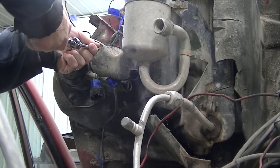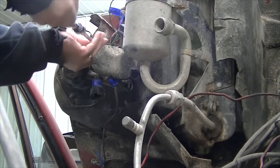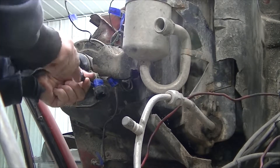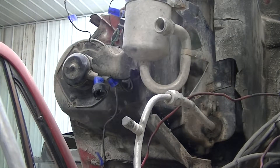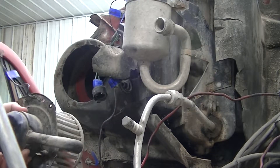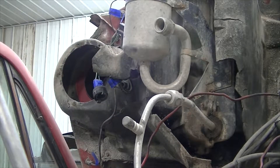In our last video we were on the left side of the engine; now we're switching to the right side and starting to remove some of the heating and ventilation controls. Here we're going to remove the blower fan motor. There are four or five screws to remove, and you can see the ground is a pigtail hanging off the top that mounts to the front of the cab. At the bottom there's a single connector that's the power for the blower.